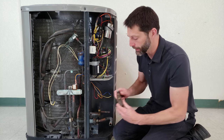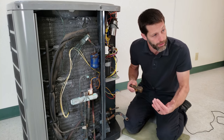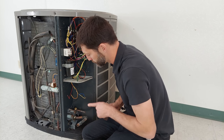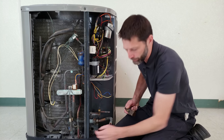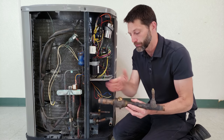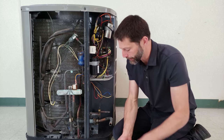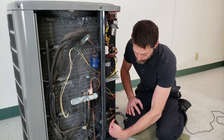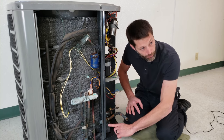It has a little Schrader valve in the end. This liquid line is still the liquid line regardless of whether it's in air conditioning mode or heating mode — it's just the direction of the subcooled liquid traveling in it. In heating mode the subcooled liquid is traveling this way, and in air conditioning mode it's traveling this way. Now here you have a ball valve — that's different on this particular one. You can shut it off just like that with an adjustable wrench. This one always has vapor in it, so you have your hot discharge gas traveling this way toward the indoor coil during heating mode, and low pressure vapor traveling this way during air conditioning mode.